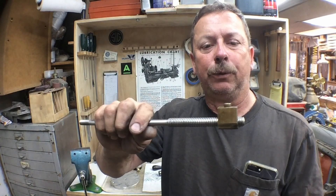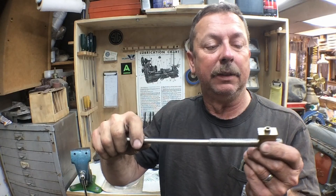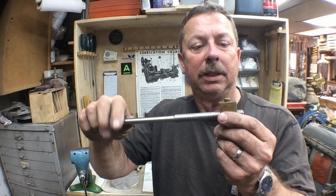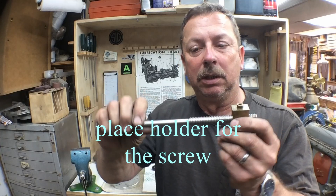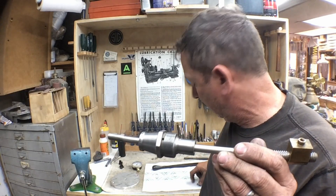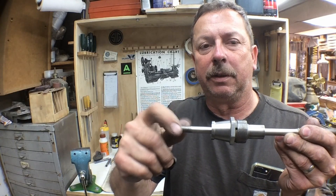It's strictly used for adjustment for where the angle on our handle is going to be on this end. So once it's set in position it won't move — that'll stay stationary. All these threads in this nut are an adjustment nut to where it sits. And of course our collar goes on this end like that and threads into the apron. Then we have a lock nut that threads on there. This end's 3.824.